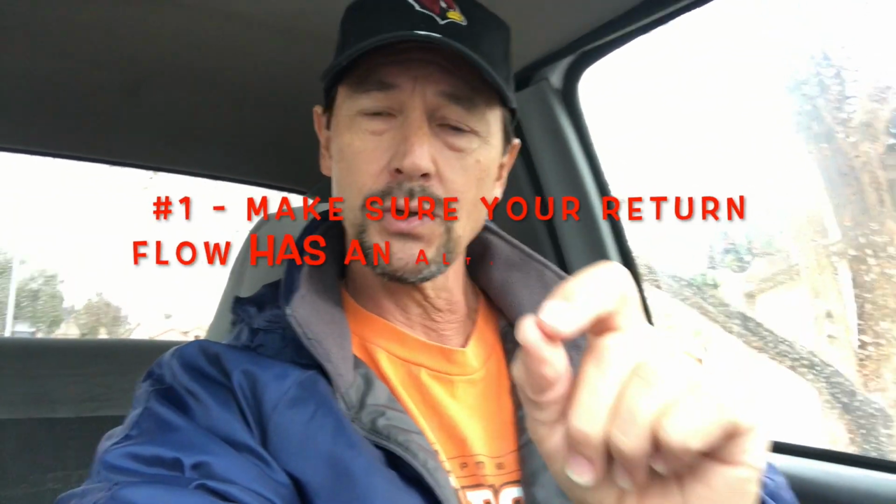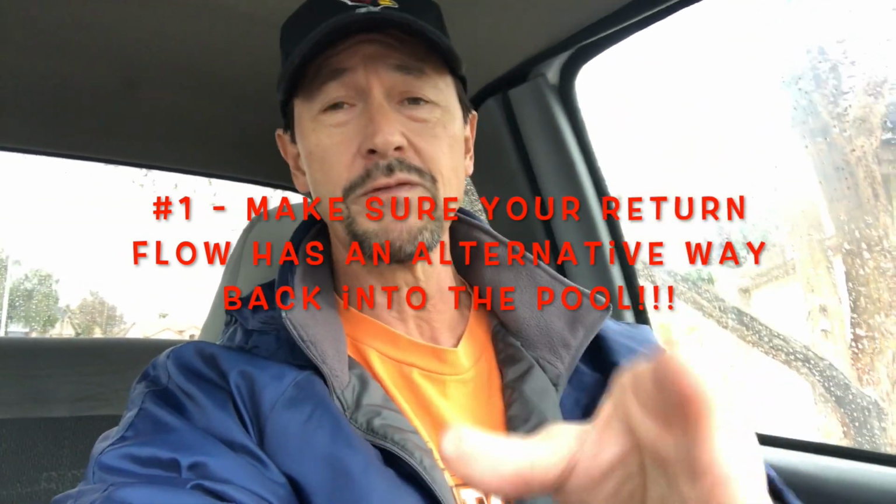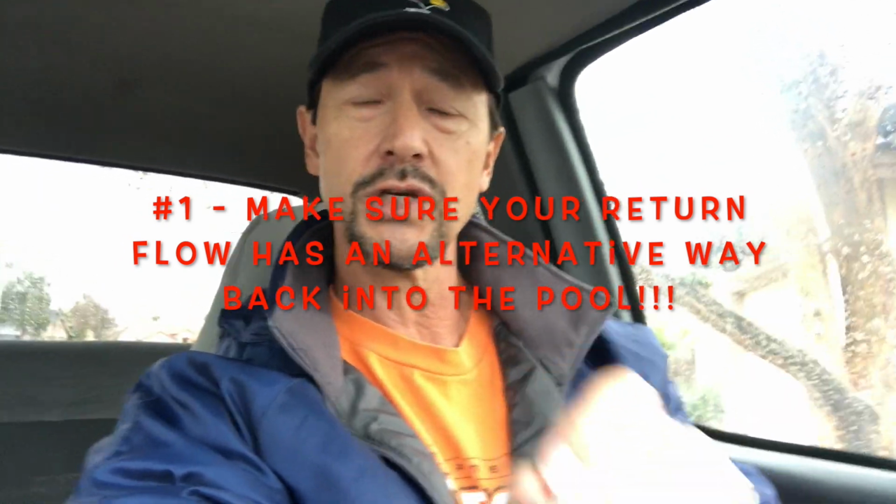Alrighty, so you have a pop-up system or an in-floor cleaning system in your pool, and you're wanting to disable it for whatever reason. The first and most important thing, and I'm going to repeat myself on this one a lot in this video, is that you have to make sure that you have an alternative source or return flow source for the return water in your pool other than just the pop-ups.